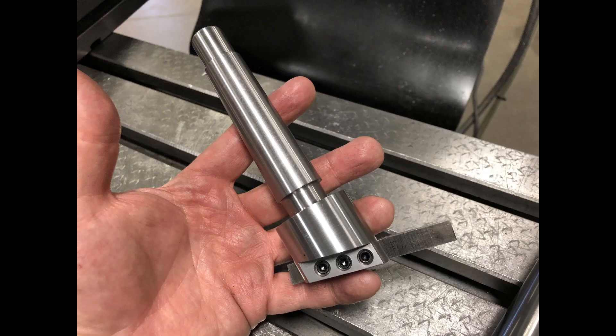Making a fly cutter for a drill press with a number three Morse taper. In previous videos I've machined tapers using a taper attachment on a standard lathe, so I decided to do something a little bit different this time. I machined the number three Morse taper and part of the body on a CNC machine. If there's enough interest I will post the CNC program in one of the links below. I've also decided to use some different machining and setup techniques than I have in previous videos.